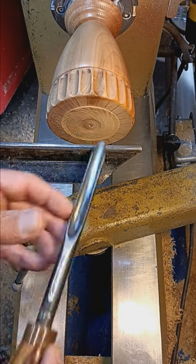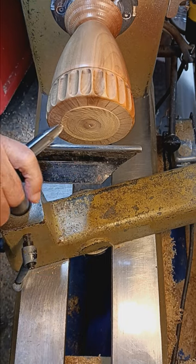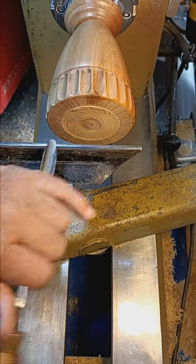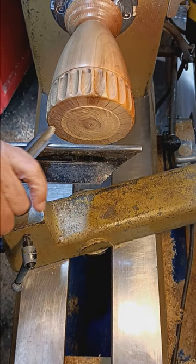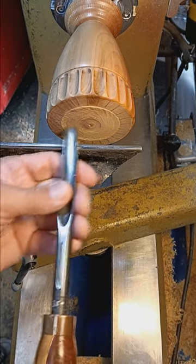What I'm going to do this morning is I'm going to hollow. The other problem people have is they're feeding from the outside in. On end grain turning, you need to feed from the center out. When you try to feed from the outside in, it's going to kick your tool back and it's going to pull it out of the chuck almost every time. So feed from the inside out.